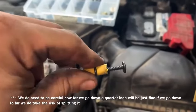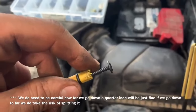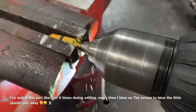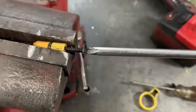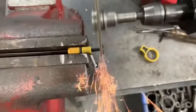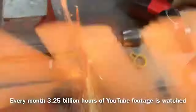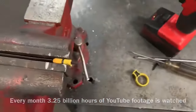Now with our pilot hole drilled, we can screw our screw down as far as it can possibly go. Then we'll know how much to cut off so we can attach the two ends. Now that I've got it inside my vise, I'm going to drill into it a little bit further so my screw will go down in it deeper. Quite simply screw the screw in until it goes down in there far enough. Do not over-screw it because if you do, it will end up splitting the plastic. Now we're going to take a die grinder, sawzall, or whatever and cut the head off of our screw.